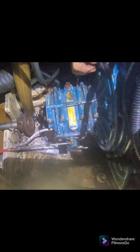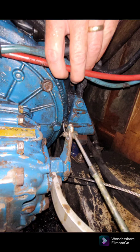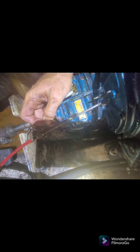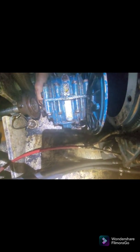Here are just a couple of shots of the bell housing and the propeller shaft coupling, so you can see the bolts and fixings that need to be removed so that you can get the space ready to actually remove the gearbox itself. The gearshift cable has been taken off and the gearbox is ready to come away from the bell housing.